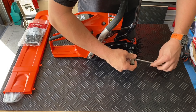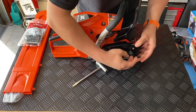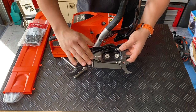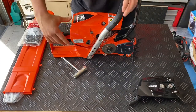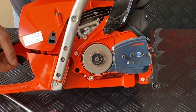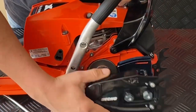So let's go and install the bar and the chain. As you will see, we apply the same system as on our new CS621SX: the drop prevention nuts, so that the nuts always remain together with the chain cover. Inboard clutch with clips that makes it easier to replace the drive rim, lateral chain tensioner, rolling chain catcher, and also the double spike from factory.